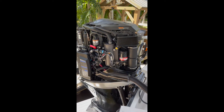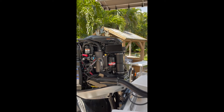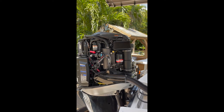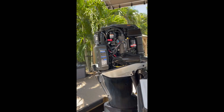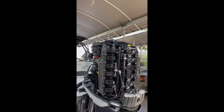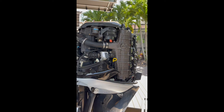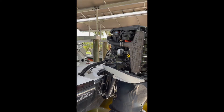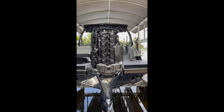On top there's another cowling, and under that is the belt that also gets changed during a 100-hour service. That belt just comes right off — all you do is move that tensioner arm over and pop it off. They've made it really convenient; I don't even think you need any tools to replace that belt. Anyway, that is a complete walkaround of what's under the cowling of a 2018 Mercury 300 Verado. Thanks for watching. Bye.